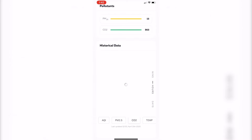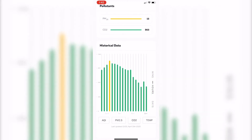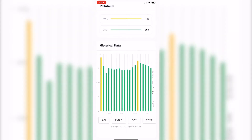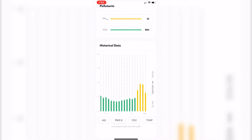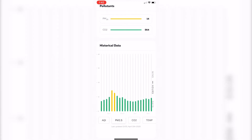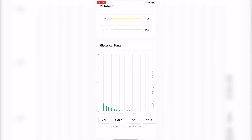After tracking it, I found that at night I was getting a lot of spikes of high CO2 in different rooms. I already had an ERV on my house, though I hadn't been using it recently because in Florida ERVs aren't necessarily the ideal situation. But I wanted to hook this up so it would bring in outdoor air on demand. You can actually see when the ERV came on, my CO2 levels dropped quite a bit. When I brought it on, my PM 2.5 levels — my particles — came up quite a bit, so bringing in outdoor air did impact particle levels. It was a little bit of a trade-off.